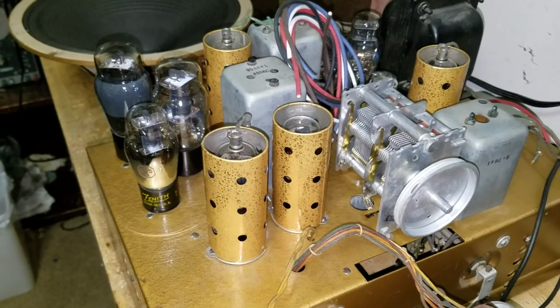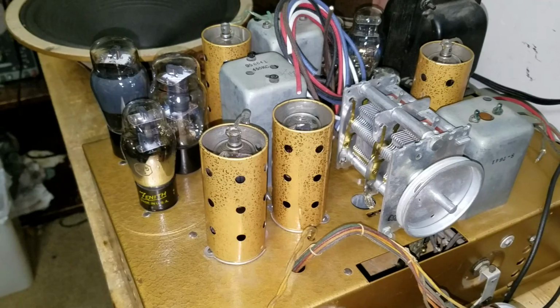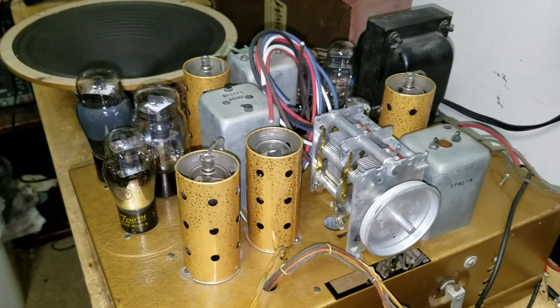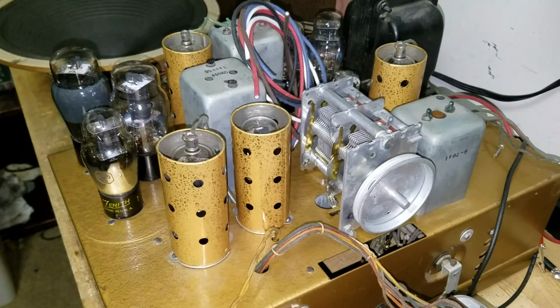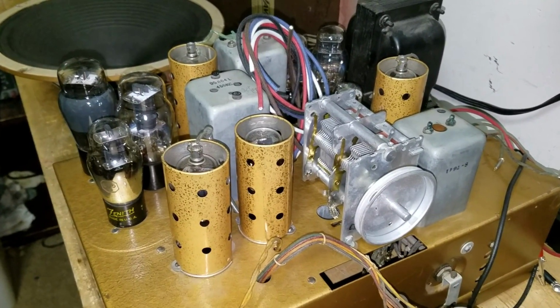Now, when I worked on the radio then, that solder heated up and flowed into maybe a place where it blocked me from putting the tube in. And so I had real problems. After I finished the darn chassis, I had to take that socket out, disconnect everything, and prepare a good socket for it. I had a real good ZENITH socket, even a 6J5 socket that was marked 6J5.